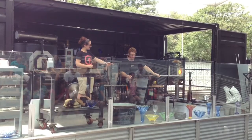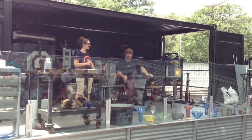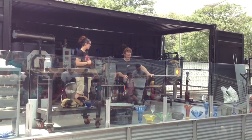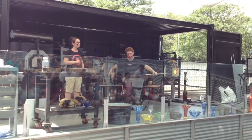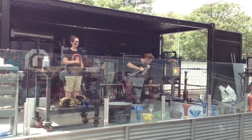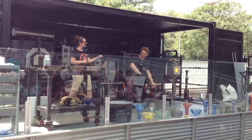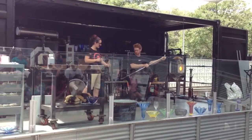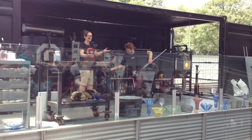As Dane shapes the glass, he's also cooling it. You notice that that glow left the glass very quickly as he began to shape it. Once this is centered up, he'll blow into the end of the hollow stainless steel tube or blowpipe to create our starter bubble. He'll place his thumb over the mouthpiece and trap the air inside, causing it to build up pressure as it's drawn to the high heat in the glass. Takes it just a second or two, but you saw that glass increase in size.